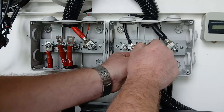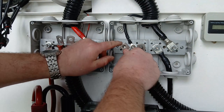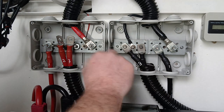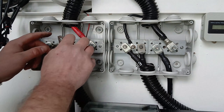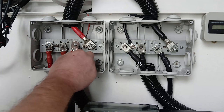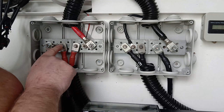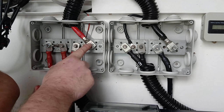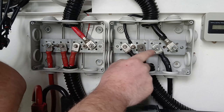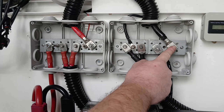So this connection is exactly 152 millimeters in total away from both inverter terminals. Battery number two is going to go in the central position, and lead number three will go on the end — so we have one, two, three on our negative bus bar. On the positive bus bar, lead number two goes into the middle again. However, lead number three this time is closest to the positive for the inverter. Taking lead number two, which is now in the middle position, the distance from that to the positive of the inverter is 76 millimeters, and the distance of its negative to the inverter negative is also 76 millimeters — a total of 152.